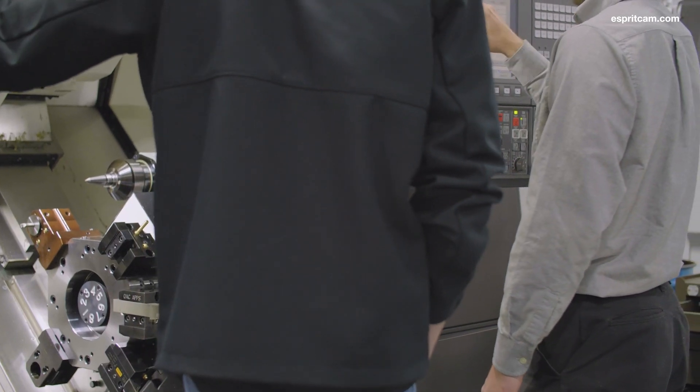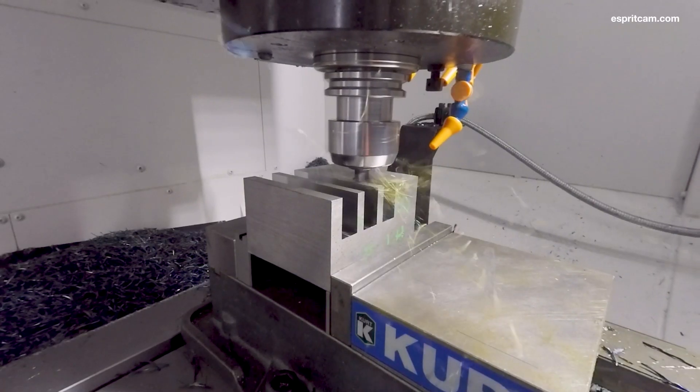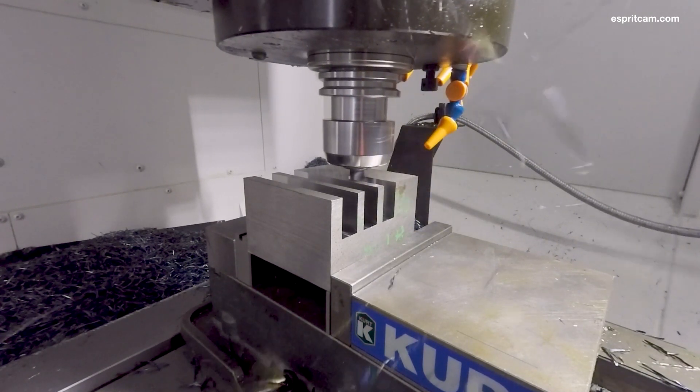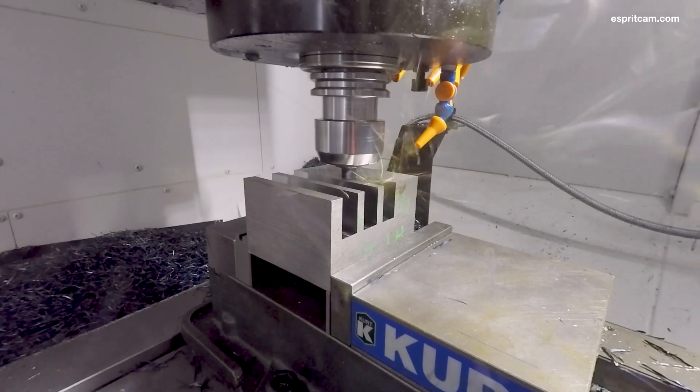More than a decade ago, high speed machining was all about taking the largest cut possible with the biggest tool you could find. What's funny is now we've done a complete 180 from that. Whereas before we were using large tools and taking big cuts, now profit milling can be used with smaller tools and light radial engagement, and this type of cutting can actually be done on a light duty machine.